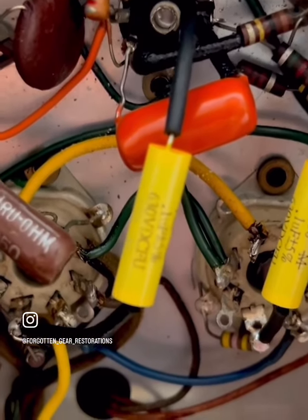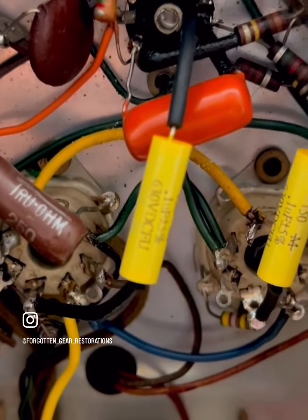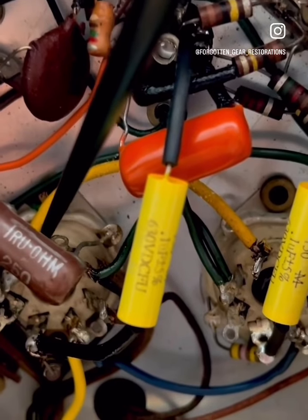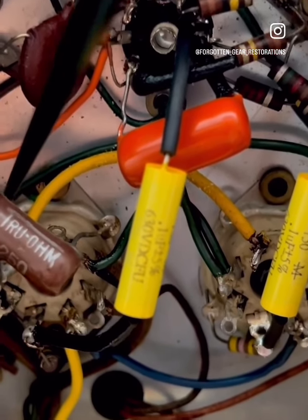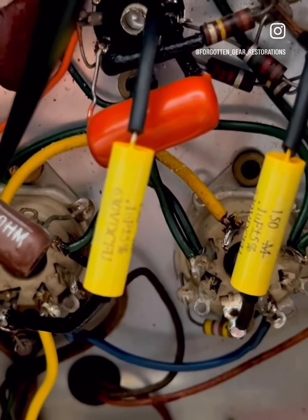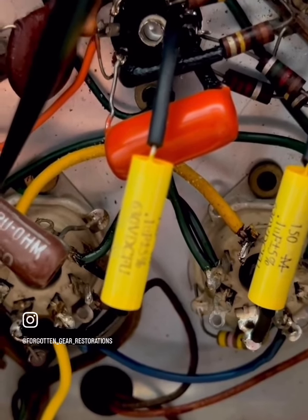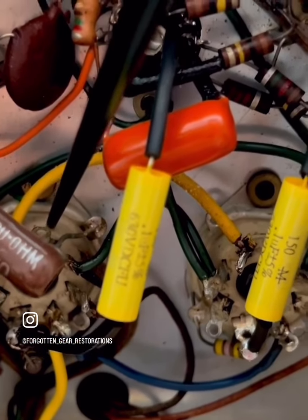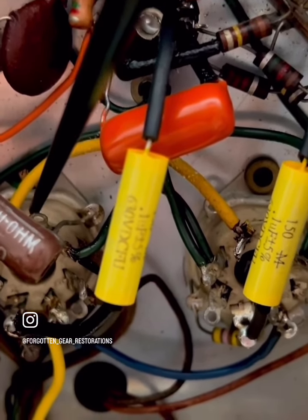Whereas you're looking at cathode bias, a pair of 6V6s in push-pull, you could bias them up to 100%. I bias them to around 95, to be honest with you. These are coming in around 65% of their max dissipation. Given the bias arrangement, it should not sound as good as it does.